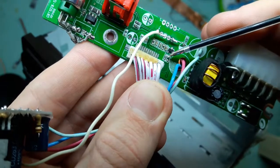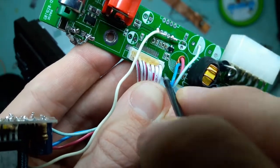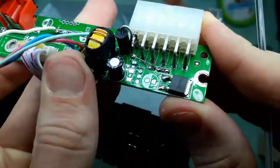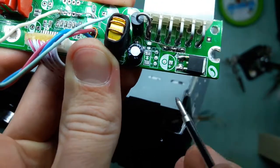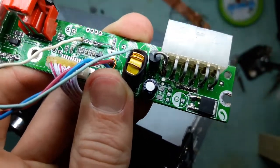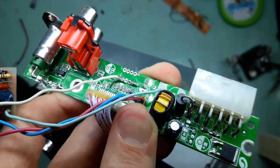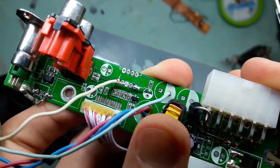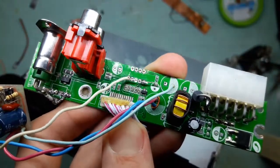That resistor, which was here, caused problems because it was connected to the collector, this pad to the collector, this pad to the positive supply from your battery, and that was skewing up the bias of the chip. And another thing that I did, I just went and desoldered the broken resistor, moved the zero ohm link from here to here, and I installed the diode in series. Yes, that will drop some voltage and you will have some power loss, and the chip amplifier won't receive the maximum input voltage to get the maximum output power. But you know what, it does not matter here. The chap uses a single speaker and it's not a very powerful one. He just wants something to babble along while he spends a work day in the truck.